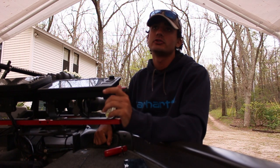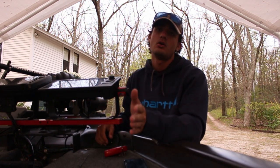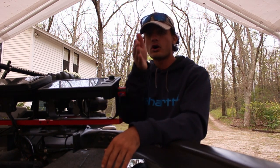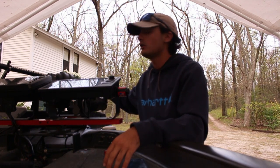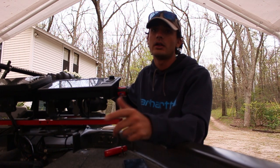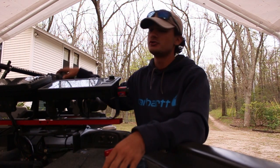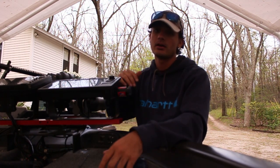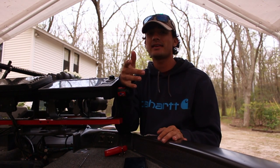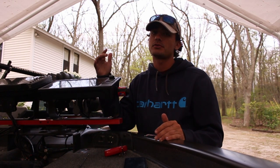The way I have mine set up is I do not run a perspective mode mount for my Garmin. Normally Garmin LiveScopes come with the mount to go on the shaft or lower unit of the troll motor, giving you the forward view that shows you the whole water column. I have mine mounted on the barrel of my troll motor to get it as far away from my Mega 360 as possible to avoid interference and to avoid hitting the LiveScope transducer on the Mega 360 pod when I lift the motor. The reason I don't have perspective mode is because my Mega 360 already provides a similar perspective — it shows 120 degrees in front in the direction the troll motor is pointing, toward the ground.